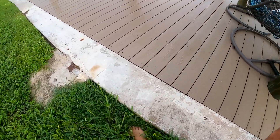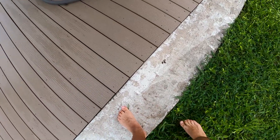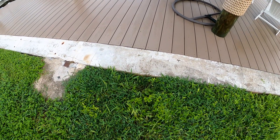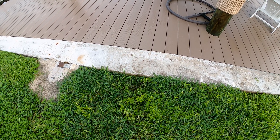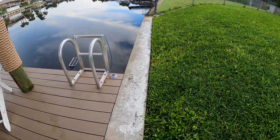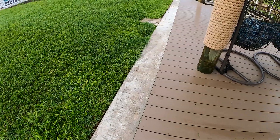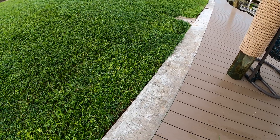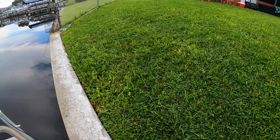So what's the problem here? With it dipping down so much, someone can step down and really hurt themselves as they're coming over this wall and I want to avoid that. So what we're going to end up doing is we're going to lift up the grass and put pebble rock underneath it, then lay the grass right back on top, and I'm going to show you guys how that's done. This is a really inexpensive way to fix the erosion on your seawall instead of spending thousands and thousands of dollars on the other techniques. This will definitely save your seawall without having to spend all that money. So let's go get the supplies.